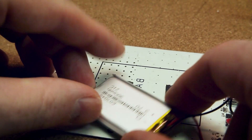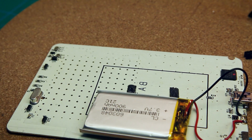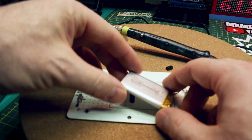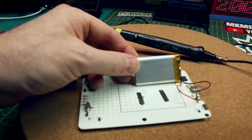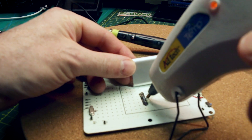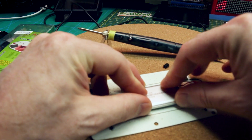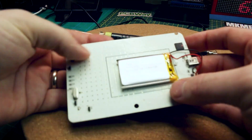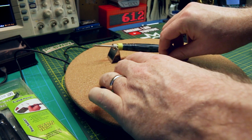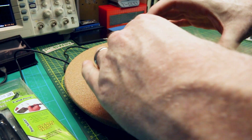Take some tape and stick the battery down — double-sided tape is fine, or in my case I'll use a little bit of hot glue. You'll find most consumer electronics will have a single cell lithium battery, 3.7 volt. I'll put links below to the common ones so you can find one that will fit your application. Little bit of hot glue, done deal. Set the keyboard membrane back in place, set the board down, put the slide switch on, and put the top back on.